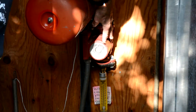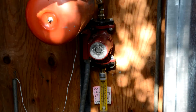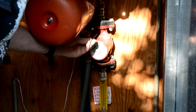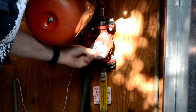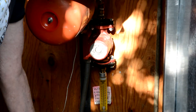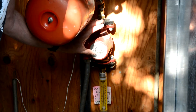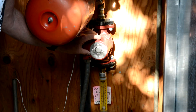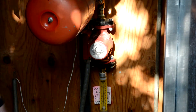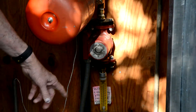On this particular installation, all they had to do was turn off the power to the pump. I have some valves to turn off the water, and then I take a four millimeter Allen wrench and take these four screws off, and then the pump comes off. I was able to lay it on the ground and replace the cartridge and put it back together. I'm going to take you over to a couple other pumps to show you the actual process, because I don't want to have to bleed this of air. This pump is in a closed-loop recirculation for hot water for a tortoise.